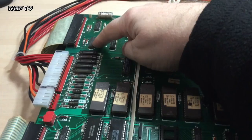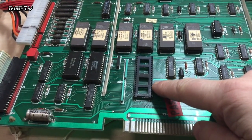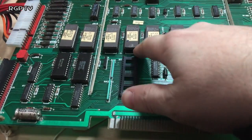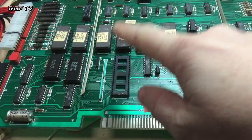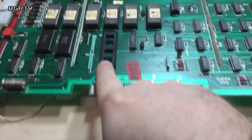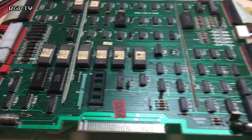Found the problem. The problem is F1 here: it has got an output, and if I push the meter probe right up against pin 26, it works. So we've obviously got a bad connection inside this socket somewhere. It doesn't surprise me, they're only single swipe, aren't these? So I'm going to replace this CPU socket for them, and that should solve the problem.